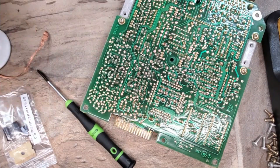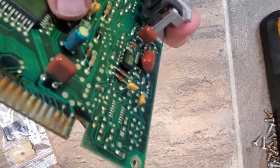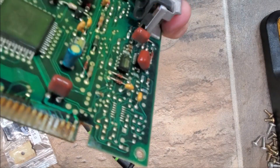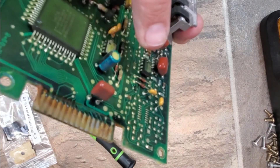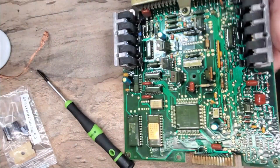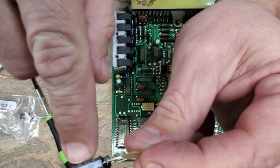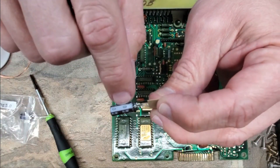It's those two there — we're going to start out there. You must note which side the black is on, which is the negative side of the capacitor. Hopefully you can see that — it says negative in there. We're going to use the 47 because that's what it is, and on these new ones the negative is indicated by the white stripe.